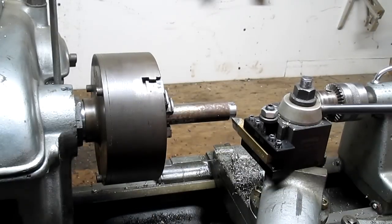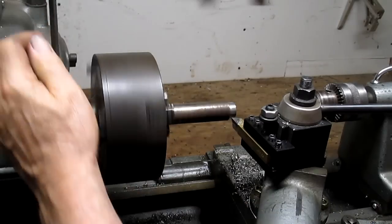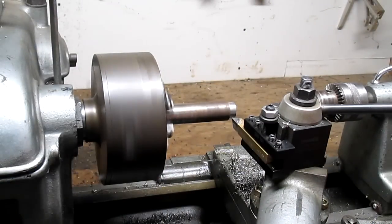This whole carriage was just sloppy, and so I took the piece that holds the carriage, kind of clamps the carriage to the bed, and it was loose by 20 thousandths. So I went in and shaved 19 thousandths off of it, and now it's much snugger. And I tightened up a couple other things and found a couple of other problems, but all solvable while I was putting it together. Now the gear drive works pretty good too. You know, you can hardly hear it. Nice.